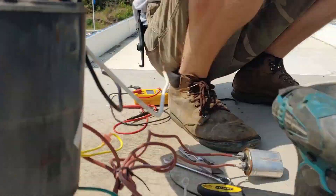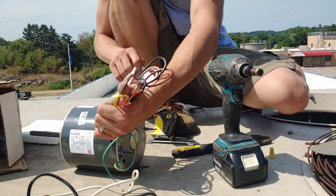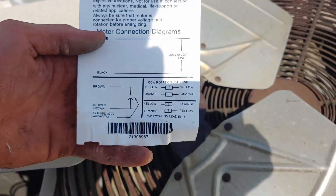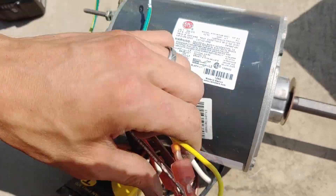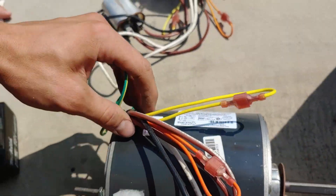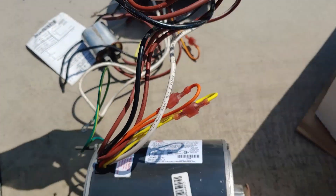There's our old motor disconnected. Our new motor comes with a wiring diagram — you can see that the brown and brown-striped wires are going to go to our capacitor. We can reverse the rotation of the motor by switching the yellow to the orange; currently those loops are yellow to yellow and orange to orange, which is also how it is on the old motor, so we don't need to change anything there. Just a ground, and our two power wires each going to a leg of 120 volts for our 208-240 volt range.